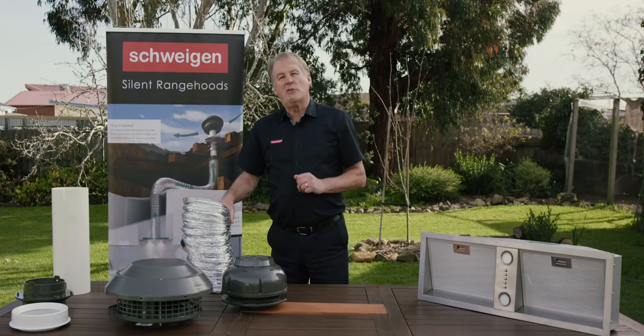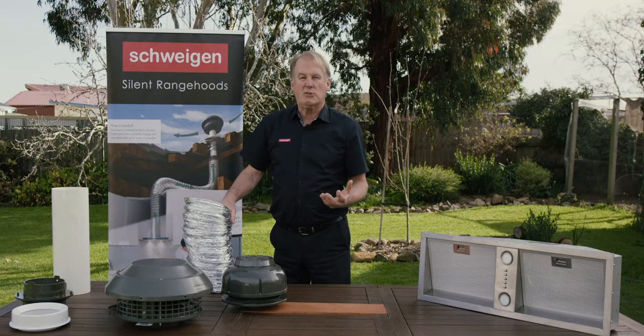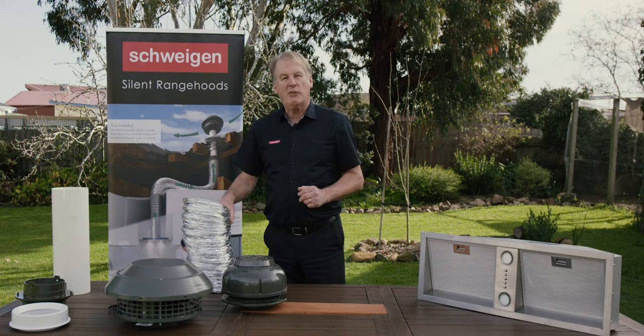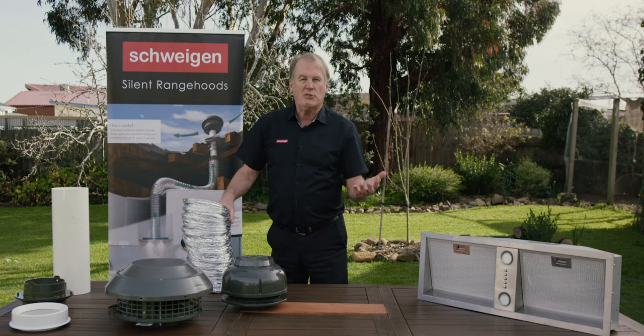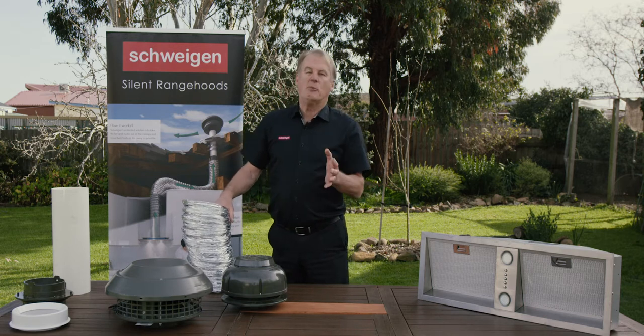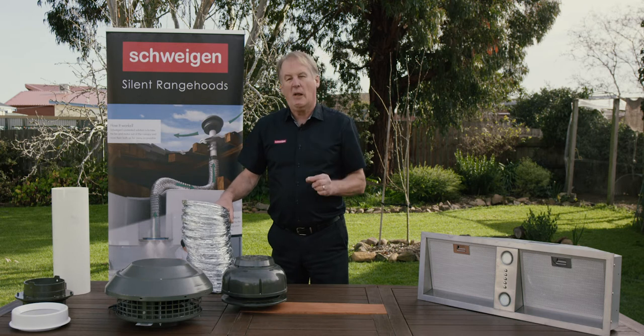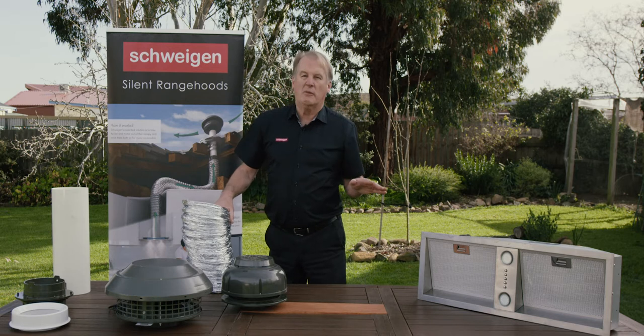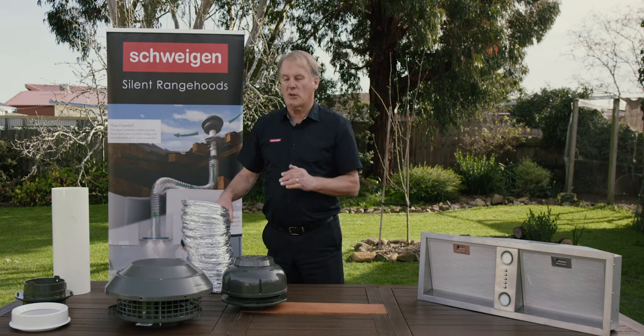What if the situation where your motor's going is further than six metres? You can add extra ducting to the six metres you've got — just purchase extra soft flex ducting. You can extend it to make it up to probably 12 to 14 metres away, and the minimal loss of effectiveness is negligible for that sort of installation.